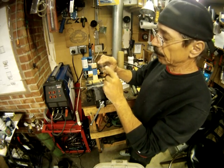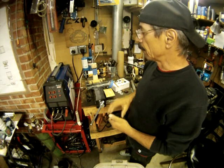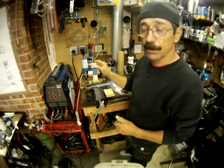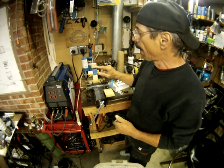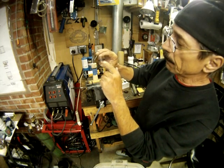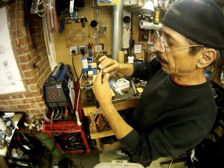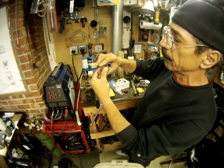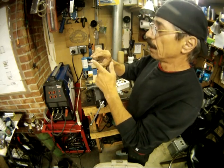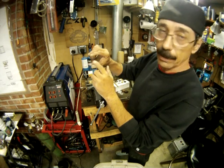I got another set of leathers and did it again, and that time when it came out, I didn't like the color. Originally, the owner of the knife told me he wanted more of a desert look, because that's where he carried this knife, in the deserts of the Middle East. So instead of a dark or black handle, he wanted a light handle. One reason this one came out so dark was I used epoxy between all the leather washers, right out to the edge. It was hard to sand because of the epoxy, and moving the sandpaper over it again and again actually burned the epoxy, which gave it this darker color, which I didn't want.